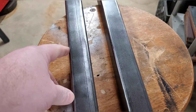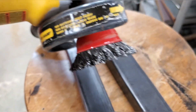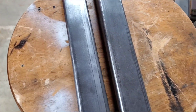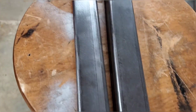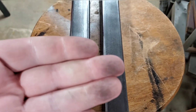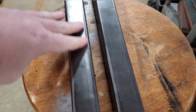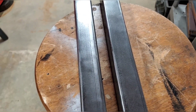I've already gone over this with my angle grinder and a wire brush, which did a decent job at getting most of the mill scale off, but there's still quite a bit on there as you can see. It's got a sheen to it, but I want it to look shiny like the edges do. When I handle it, that's mill scale coming off — this stuff is so hard to remove. You can use a flap wheel to take it off, but the problem is it loads the disc.